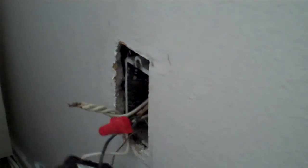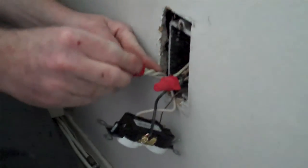And here I see these wires — you've actually taken the time to strip these wires and then twist them together. You didn't just bring three wires together and put a wire nut on it for the wire nut to hold them together; they're actually held together by twisting them. The idea of that is that if this should ever come loose, you still don't lose your connection there. I guess this is how we get away with putting the 10-year warranty on the parts and the lifetime warranty on the workmanship. That's how we do it.